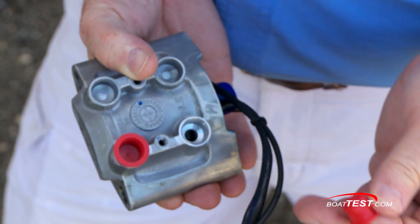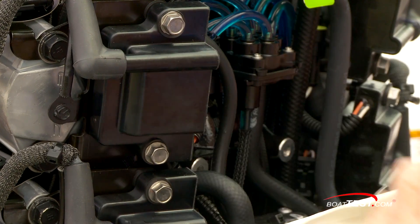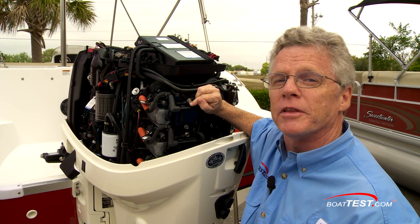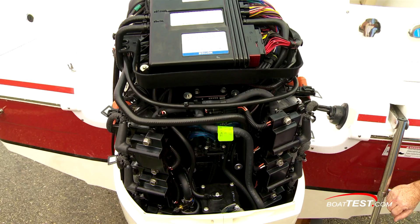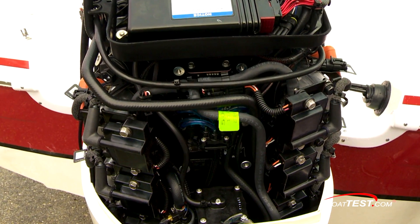The amount of fuel is controlled by the EMM. Now look at all the bolts — they have washers milled right onto them, and they're stainless steel, whereas elsewhere in the industry we see painted nickel-plated steel. I can validate that by seeing that this magnet is not attracted to them. All the aluminum components are low copper alloy for great corrosion resistance.